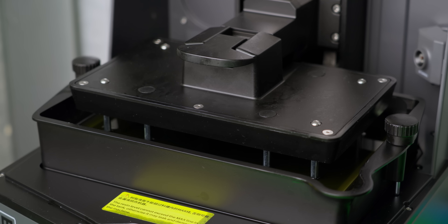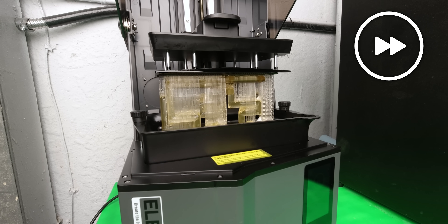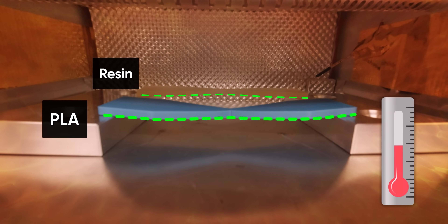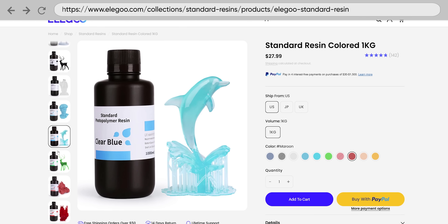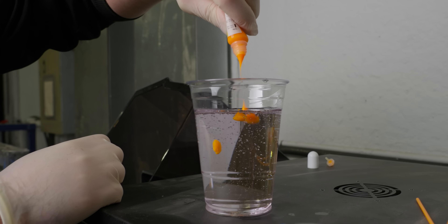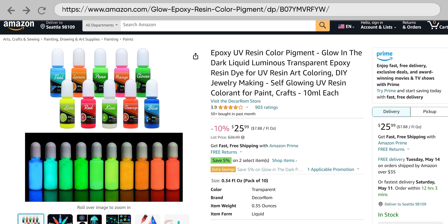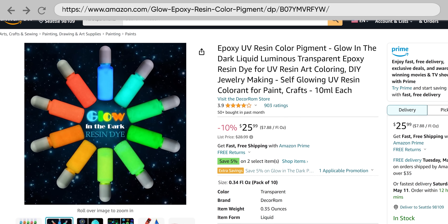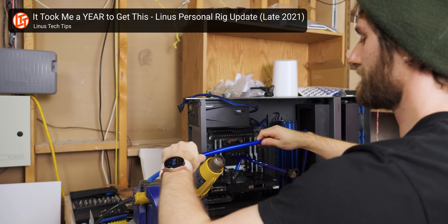SLA printing is super cool. It works by UV hardening resin in a vat. One of the biggest advantages, aside from a lack of porosity and a glass transition temp that's higher than PLA, is customization. You could buy resin in various colors and keep them all in stock, or buy clear resin and dye batches whatever color you want, or use UV reactive dye to make your tubing glow under a black light. SLA printing is also the secret to achieving shapes that would be impossible with traditional manual bending — I've done a fair number of hardline water-cooled systems and I am not about to try to bend my own shell spiral.